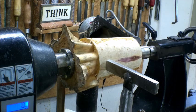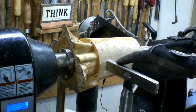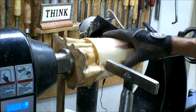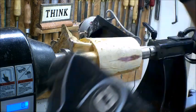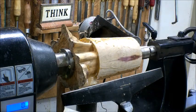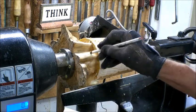I've got this all glued up. Before I took this off, I wanted to show how I did this: I put a rest right here where it's not quite touching and then spin this to see if there's much difference in the distance, which lets me know if I got it pretty close. The thought here is I want to leave the bottom sort of like it is, but I'm going to have to blend this one to this one right here.